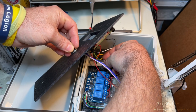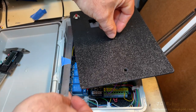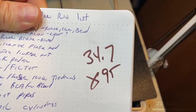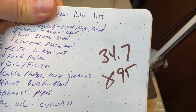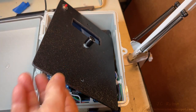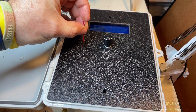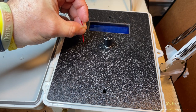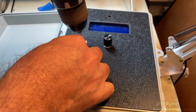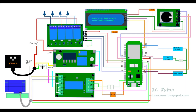I got ahead of myself again and wired the front cover to the internals before measuring the distance for the center of this button. I measured it, marking the reference with a razor blade, measured the two millimeter gap, and came up with button center coordinates of 34.7 by 95 millimeters. Using calipers I scribed a center point and drilled a small hole to accommodate a paper clip — I had to drill from the inside. With the box closed, a piece of wire thicker than a paper clip has no problem hitting that button. I then affixed a reset label over the hole.